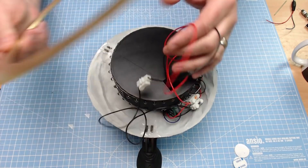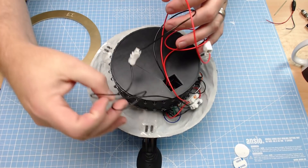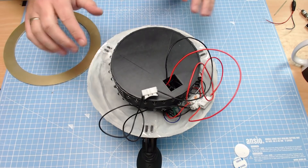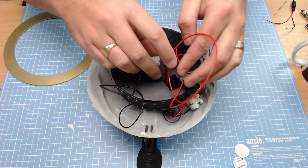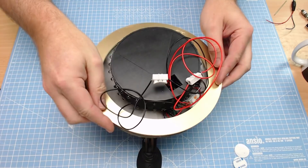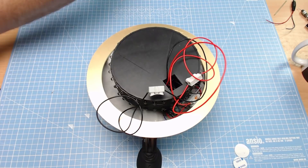At the moment it seems like it fits flat, but it's not completely flat — I do need to sand down just a bit more off these edges and that will make it flat. All the power for the whole bottom of this is in place ready to go. These two wires coming up here will provide power for the upper section of the ship — they're also powering this section at the moment. It all comes from the jack plug down here and it's all being run off five volts. The Arduino seems to like it.